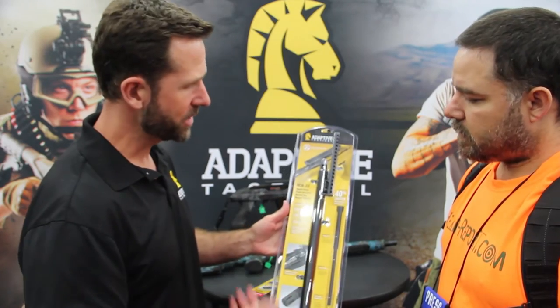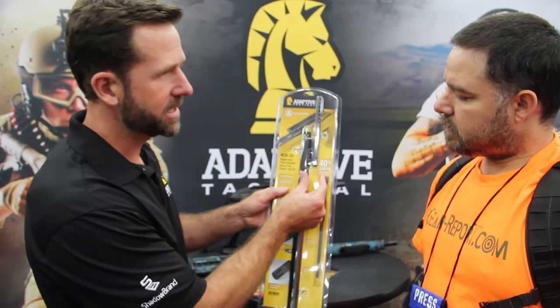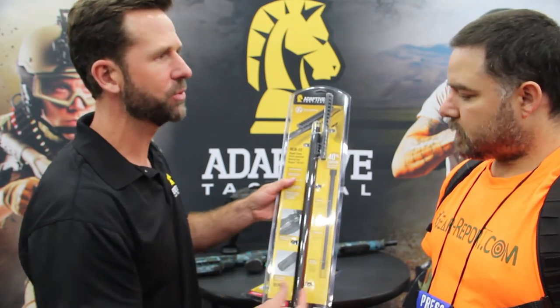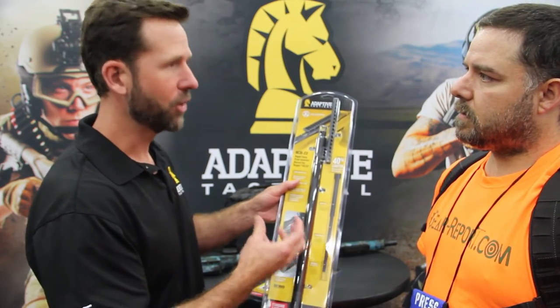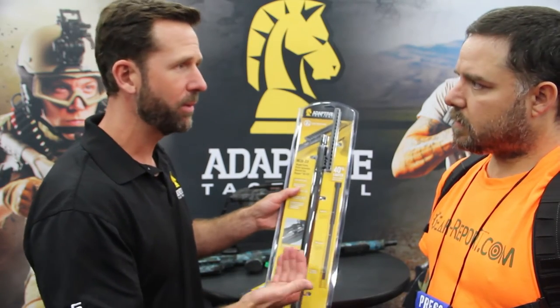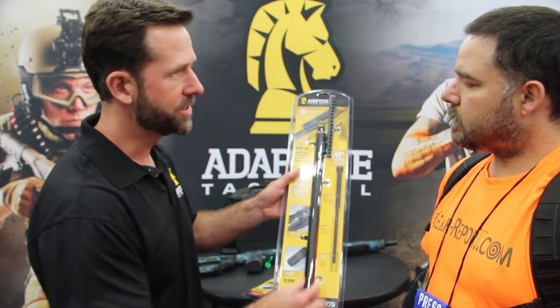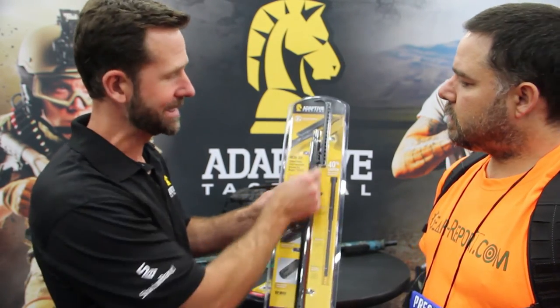The Tac Hammer barrels — basically what we tried to do is, and you can look in the package here, we necked down the steel barrel. We took a bull barrel and necked it down and stepped it down as much as we could, but still kept a solid steel barrel in the middle so you don't have an insert like you do on some of the lightweight barrels. It's stepped down and then we include an aluminum cerakoted sleeve that gives you that 0.920 diameter consistent throughout.